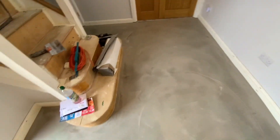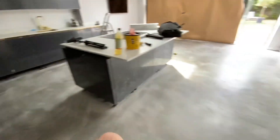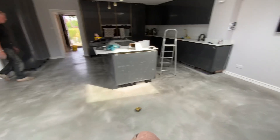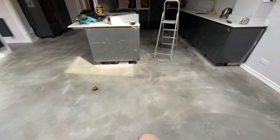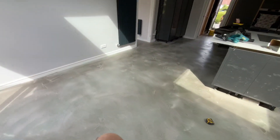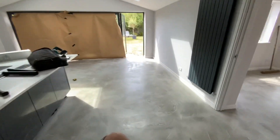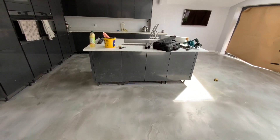Today's floor is being done in the herringbone pattern. We're about to set out and show you what to look for, because that back wall is going to be your main view, and you've got a side view as another important one. We're going to start with the line from the doorway front to back, because that's the dominant one. If it gives us good cuts everywhere else, we should be able to do it. Another important one will be the middle of the side door, and you also want good cuts around that island.